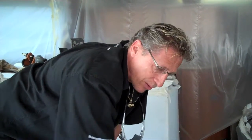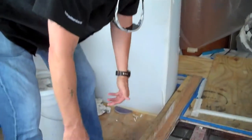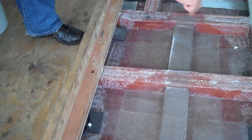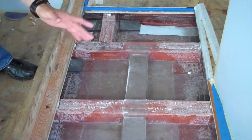Then we're going to tab the underside, grind back six inches each way, and do a staggered and tapered layer underneath so it's set. Then we're going to remove the flooring and the bracing we have here, peel back the floor another six inches here and a little bit over there, and then laminate the whole thing with three or four more layers, tapered and staggered.